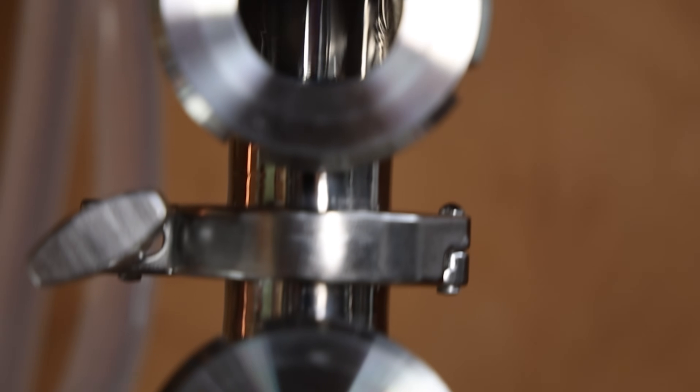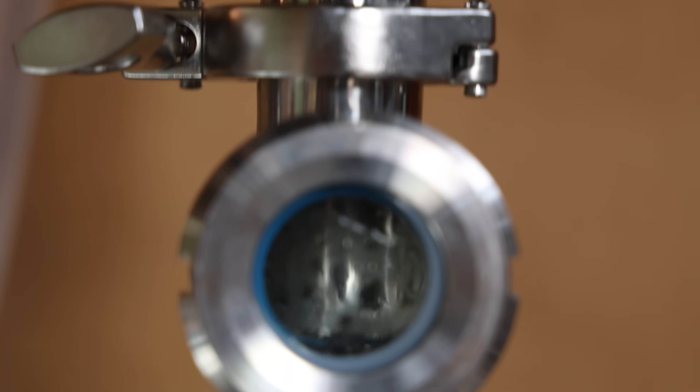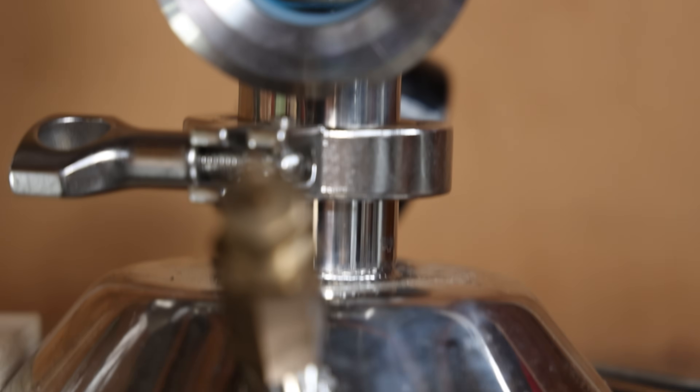So let's fire this thing up, shall we? The vapours just started to hit the condenser and I managed to very quickly turn the power down from full power because it was flooding fast. It looks like the go, at least for the beginning of the run, is going to be around about half power — so about one kilowatt going into the pot — and it seems to be reaching quite a nice little balance.